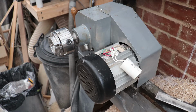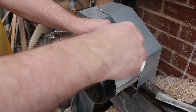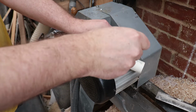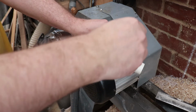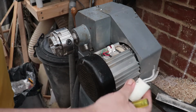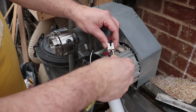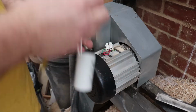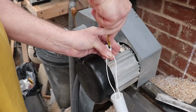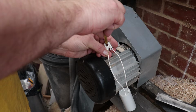Let's find out. Using an insulating screwdriver because it's electrical work, and this choc block is going to make this very quick and easy, at least to test, and then I can do some adjusting of lead lengths if necessary. Originally these were just crimped on. There we go, possibly the offending fellow. I'm going to carefully put that to one side. Let's connect the new one. Check that's on the wire and the sheathing's in. Okay.